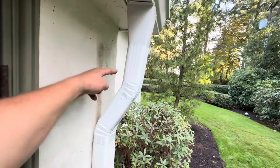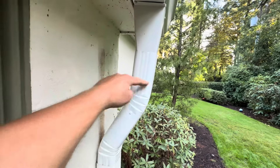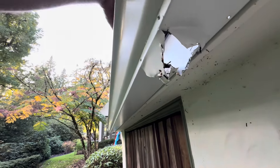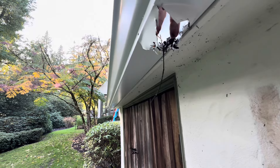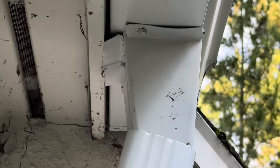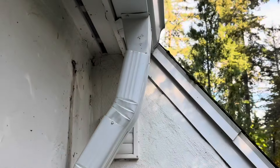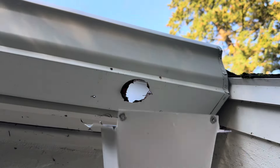These things are so tall here - leaves a big gap. You could potentially cut them off right here, and that's what we're gonna do. Guys just don't get it - look at this, this is how they left it: a million sharp edges, not the best. This outlet is like pushing the gutters out. Do people have common sense? And look at this downspout - wow, surprise: max flow outlet with a tiny hole.